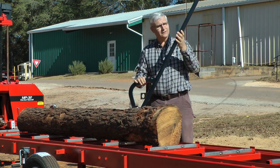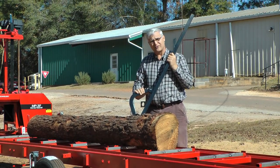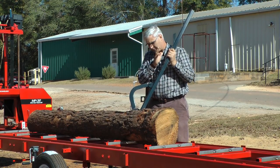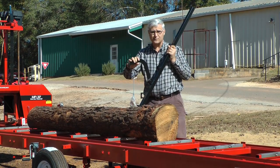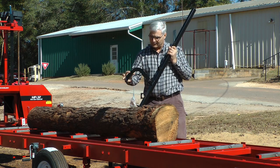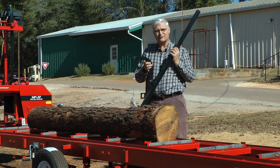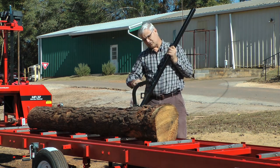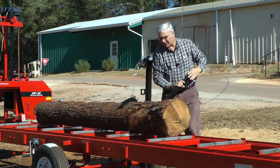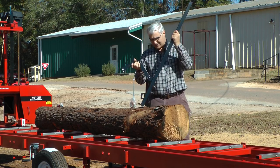So we have a cant hook that's just metal tubing. It's very functional — you can see it's made out of square tubing, half-inch plate this is cut out of, so that's stout. We have a piece of rod that we cut at an angle and boy, it grips real good. We've tested these things over the years and changed the hook angle so this thing will just really jump in there and grab on a log, grab a good size log.